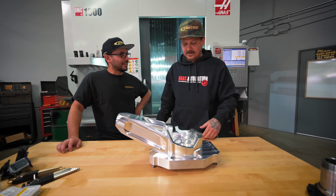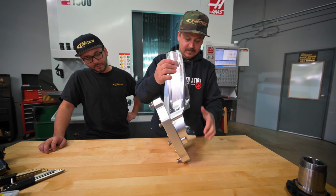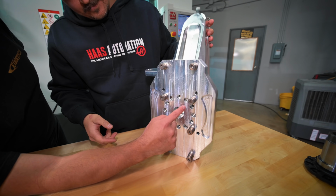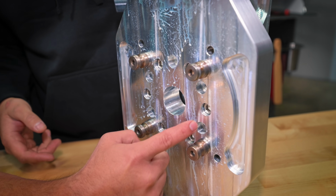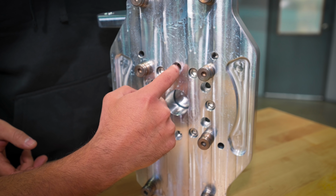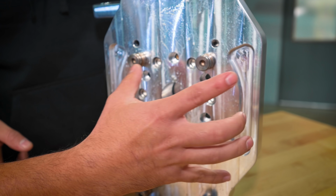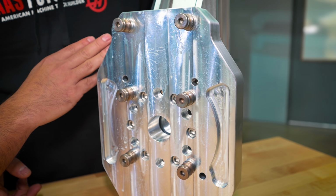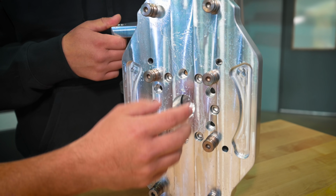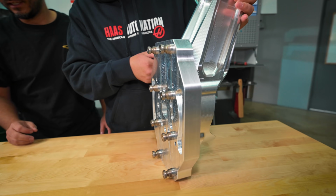It's actually pretty light. Yeah, with the fixture plate. So that's how it's actually held in there. We actually have 6 bolts bolted to the spindle, and then we have dowels here, here, and here. So 4 dowels that are actually locating and helping hold the index or true position to that fixture plate. Then these pull studs are obviously screwed in, and that's how that whole setup came. Yeah, let's pull that off.